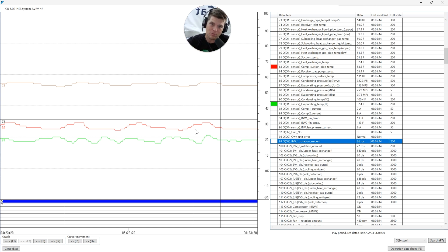Now that I've made the changes on the system - found liquid refrigerant bypassing heat exchangers, made the change for the better - I waited because I understand what an accumulator does and how much refrigerant it can hold. Once the liquid refrigerant in that accumulator boils off, now there's only vapor in the accumulator. The lines got close, then drifted further and further apart and stopped - sitting right around 18 to 20 degrees of suction superheat. That's a solid suction superheat.